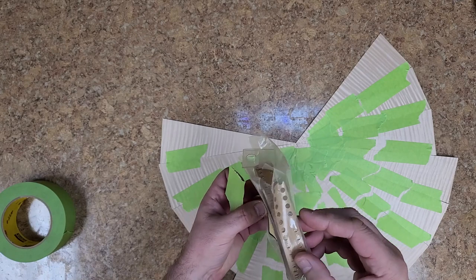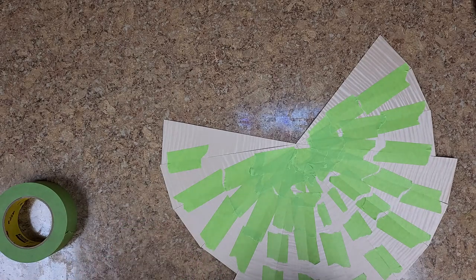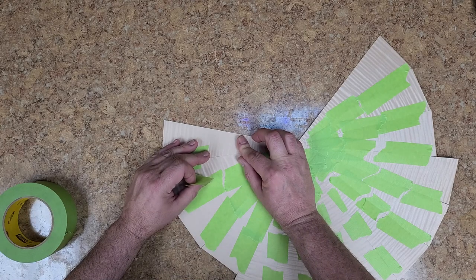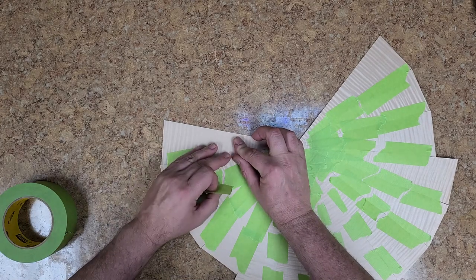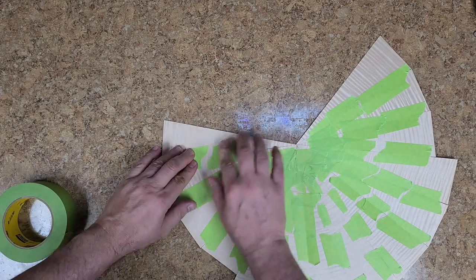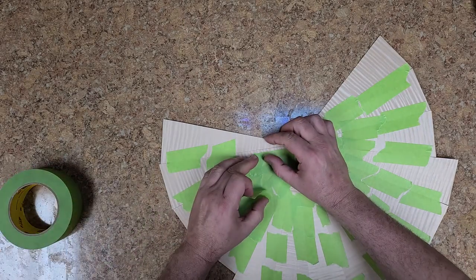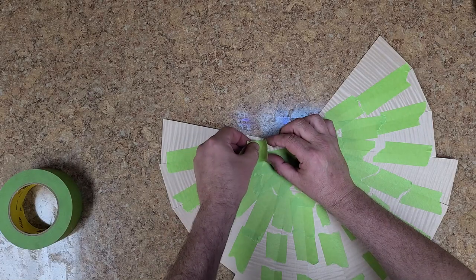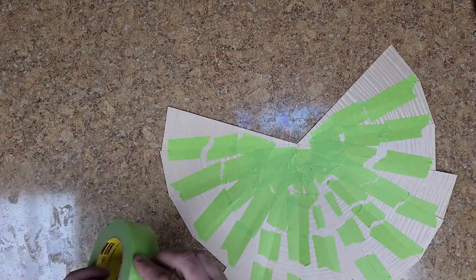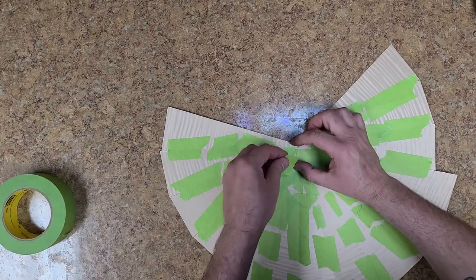two-hole perforated veneer tape. And what this is supposed to do is you're supposed to be able to glue the veneer together on the back or the top. I know the holes are supposed to let glue in, so that the veneer gets stuck all the way around. But you have to wet that stuff. It's got a piece of that is activated by water. The problem with it is I don't want to wet the veneer. And wetting the veneer is going to make the veneer swell. And then you use an iron to kind of dry it real quick.